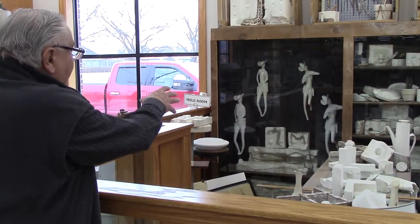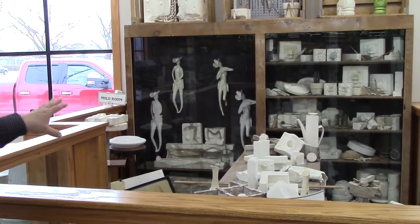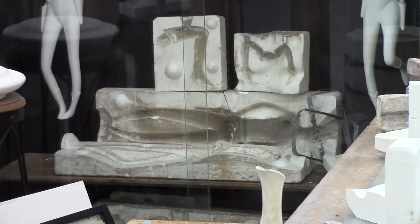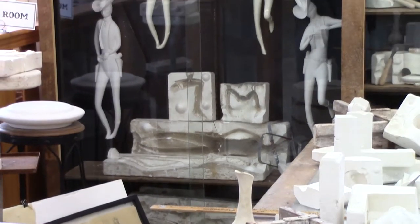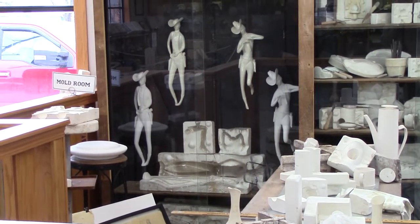So that's a quick overview of the process. However, everything wasn't as simple as a two-piece mold. I'd like to go back to the cowboys. For example, the molds that you see underneath the four cowboys here — it took those molds to produce the cowboy on the right-hand side. The body was poured separately, the cowboy hat was poured separately, the two arms rolling the smoke were poured separately, and the knee that's jutting out was poured separately.